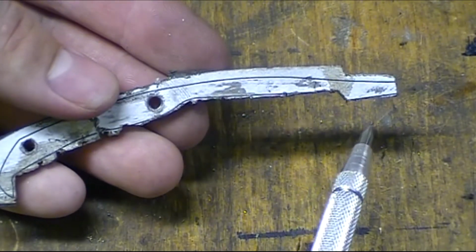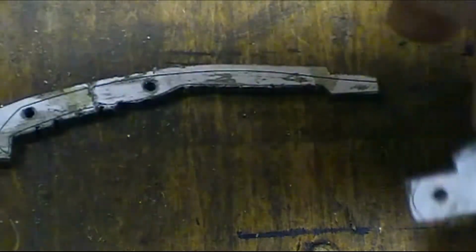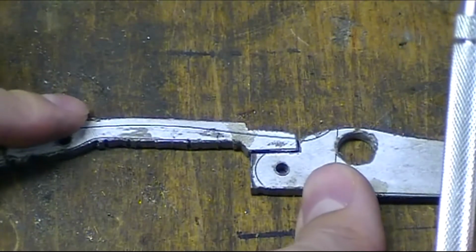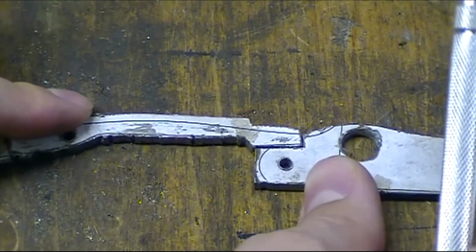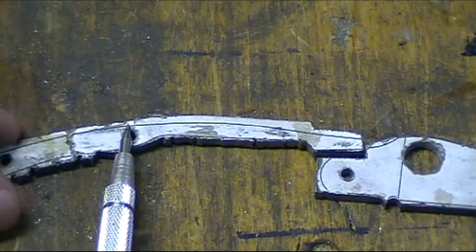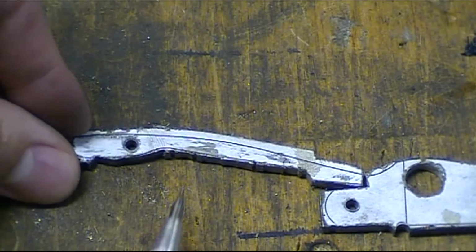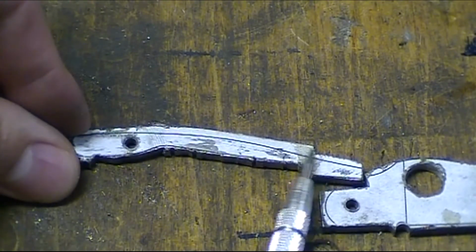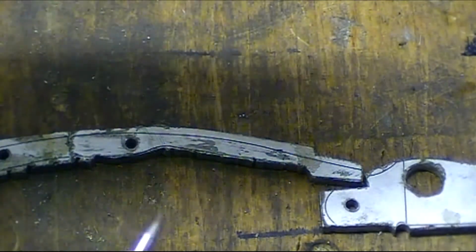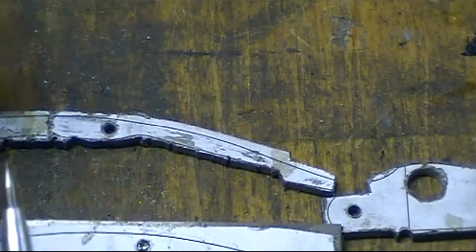So when I set the spring, that means I put tension on the spring. I'm going to bend it down during heat treat so that it's going to push up against the back side of the blade. So the way it works, they lock down. This has to keep pressure to push down to keep it locked in place. So I'm going to stop cleaning it up here and leave this extra material, so when it pushes down below the liner, I can come back and grind it flat. Then I don't have an awkward gap where the spring is not flush with the back of the liner. You can see.